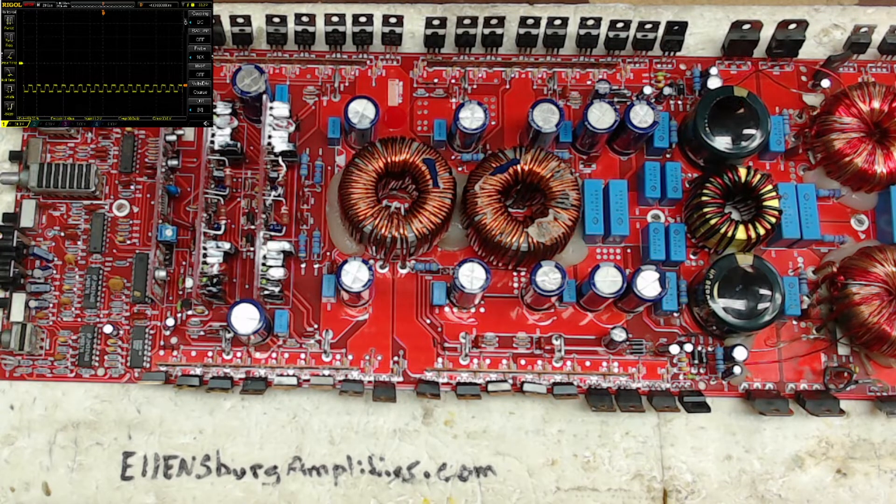So that's my lesson today on the Orion 2500D board and the issues with the 31/20D transistors. Again, if they're heating up, find those transistors that show as a diode between 2 and 3. Thank you for watching — if you like this kind of content, please like and subscribe and leave your comments below. I do apologize, there is some construction going on so videos are getting a bit thin, but I'll get them out as much as possible. Thanks for watching — catch you on the next one.